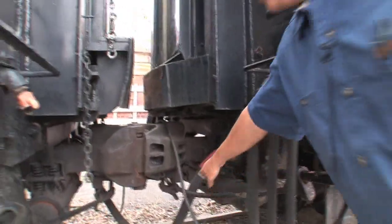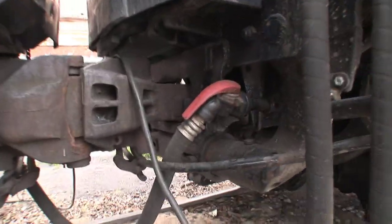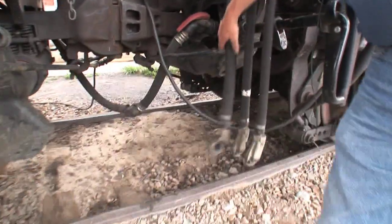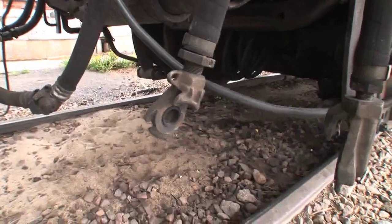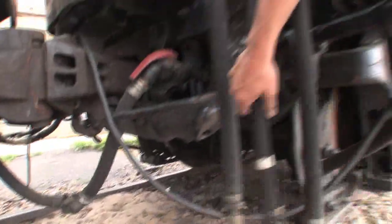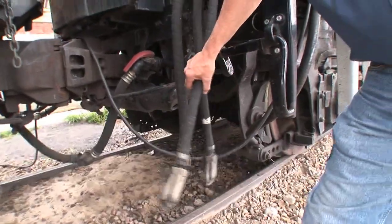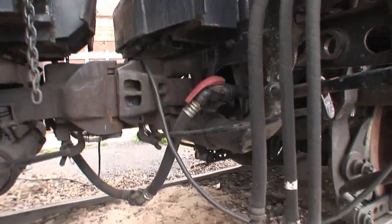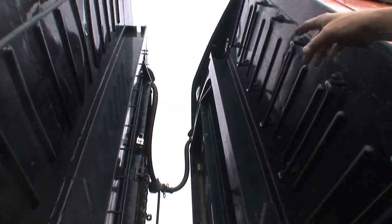This is the main train line air hose for the brakes. This is the brakes between the locomotives. This is the main reservoir, this is the equalizing reservoir, and then this is your control between locomotives. The electrical between locomotives for control is done with the MU cable.